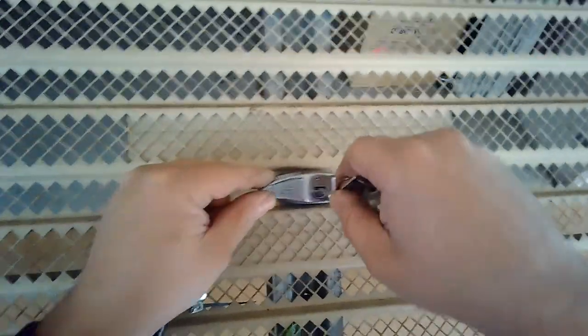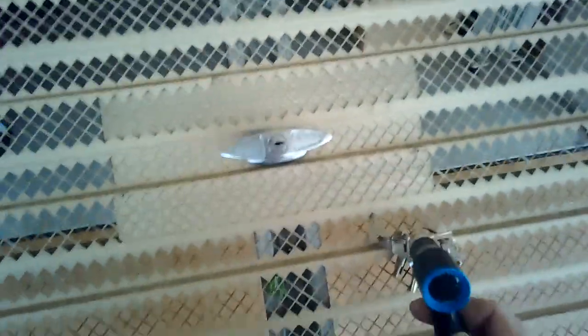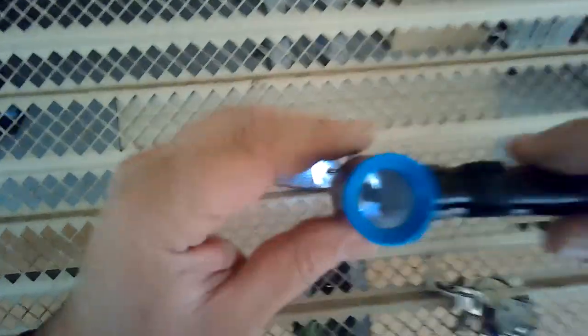In this video, we're going to be looking up missing cuts. So this is helpful if you've got a broken key or only half a key, or if you're key reading and you're going to try and find the code for a lock. So we're actually going to look it up, then use Instacode on the Silca Futura and cut it to code.